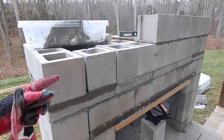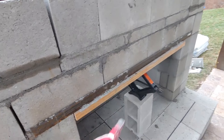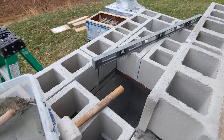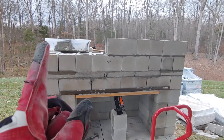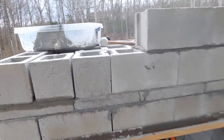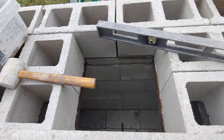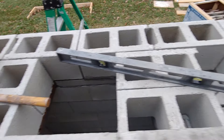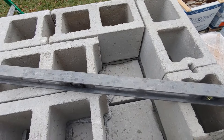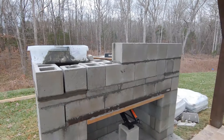So this is row nine and row ten being built right now. That's been set up now for about 48 hours. Here's what it looks like over here on this side. Because I'm making some changes to the plan, it's 80 inches all the way across. We are going to do a gap right there — we put two blocks right here and this is going to make our 16-inch chimney. So this is a 16-inch square all the way around — that's our hole for the chimney going all the way up. And then this is just a void right here, that'll just be space, and we fill it in around the corners. That's it for now — making some progress.